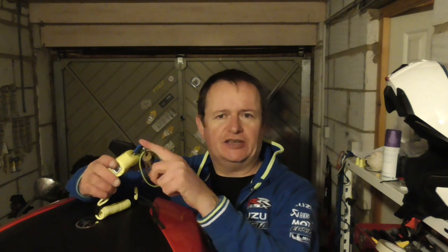3-in-1, by coincidence, is also the name of my OnlyFans channel. With the 3-in-1, it's best to put the key in around about halfway and then drop the oil down the key so it gets nice and deep in the lock. Give it 10-15 seconds, push the key home, and again — lots of movement on the wrist and away you go. Anyway, that's a quick top tip for keeping everything oiled up.